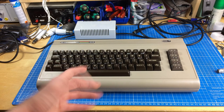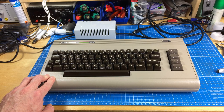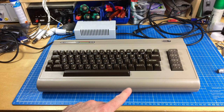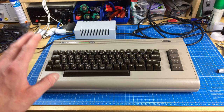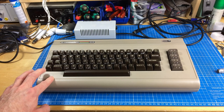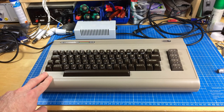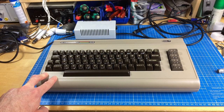I made a lot of mistakes while building this but managed in the end, and it's a very handy device. I have four different kernels on one EEPROM that is built in here, as you can see. What I'm going to do today is something I didn't do before. I did a lot of mods on this - changed all the capacitors and put heat sinks on the ICs that get hot. What I didn't do is replace the voltage regulators.